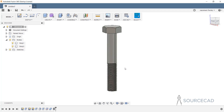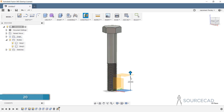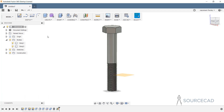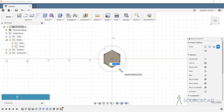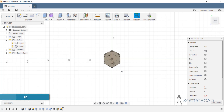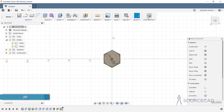The thread is added and that's our bolt. Now in a similar way we can add the nut as well. To do that, I'm going to start with a plane — I'll go to construct offset plane, select the bottom plane, and make a plane at a height of 20. Now we'll make our nut on this plane. I'll sketch on this plane, type C for circle, use the origin, and set the diameter to 12 since we're making an M12 nut. Then type C again for another circle with a diameter of 20 units.